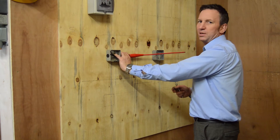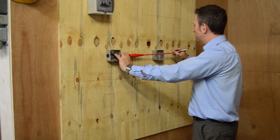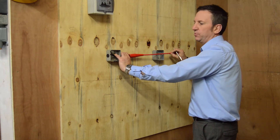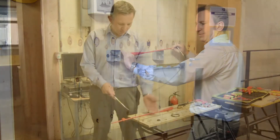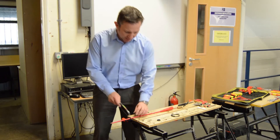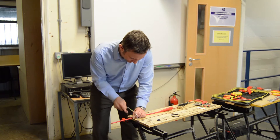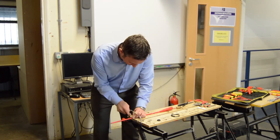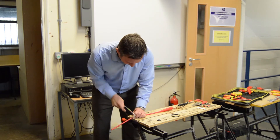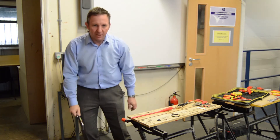What we're going to do is cut this cable to length, so make sure again you add at least two or three fingers, and we put our final mark where we're going to cut it to length. Now we're going to cut this MI cable to length using our junior hacksaw. So we go over to our press mark we made and cut our cable to length.